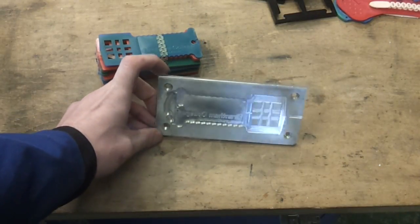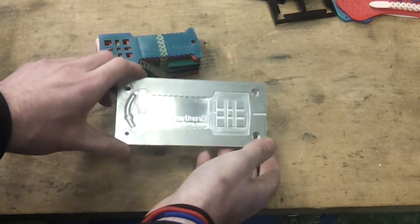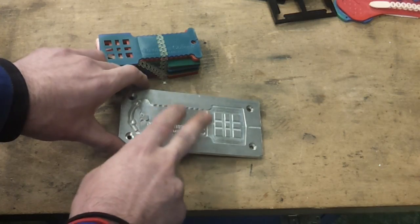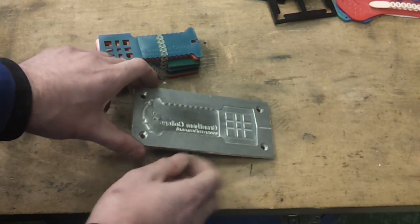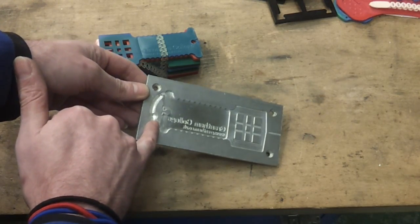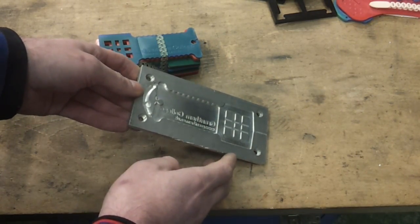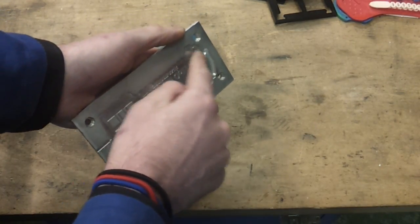Once you're armed with the right equipment, putting together a mould is something you can do in an afternoon. It's essentially just a plate of aluminium with some bolt holes drilled through it so you can mount it onto the mould base sitting in the machine, and then you cut out the design. You can either use proper CAD software and let the software figure out the cutting path, or you can do what I do — think in terms of how the cutter has to move to create the geometry you want, and work in 2.5D, kind of like a contour map. You need a feed point at one end, a runner to carry the plastic down to a suitable injection point, a couple of small gates to feed into the part itself, and a very small vent at the other end. Because the mould base has a flat plate on the injection side, I can literally get away with a single plate, bolt it into the machine, it closes off against a flat plate, injects through that plate into my feed point, and hey presto, you get the moulding.